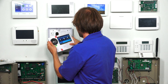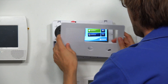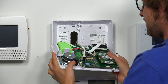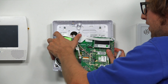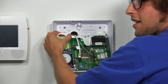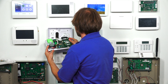So I'm just going to go ahead and close this up — we're not going to trigger an alarm. It kind of just snaps into place. One thing I do want to show you — I'll have to open this back up again — but this is important: 2GIG recommends always connecting the backup battery before you do the AC power. We have the backup battery — it's the green pack right there, and its port is right there above the barrel connector. 2GIG recommends connecting the backup battery first, then either do the barrel connector or the terminal block.